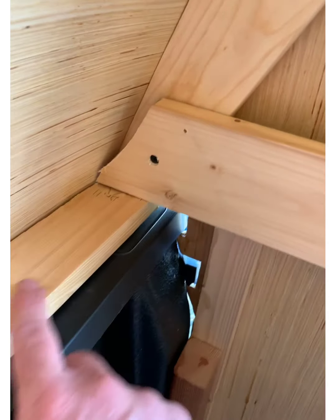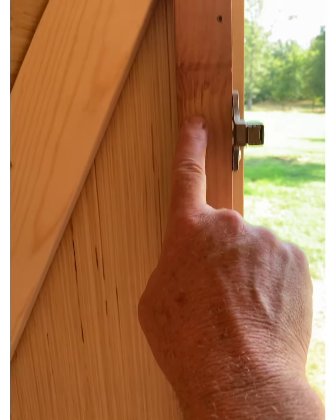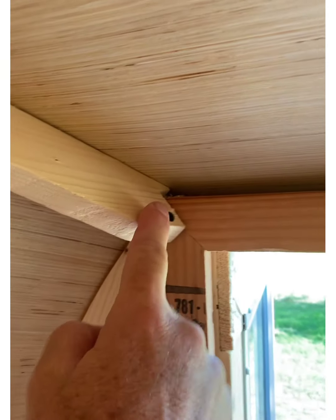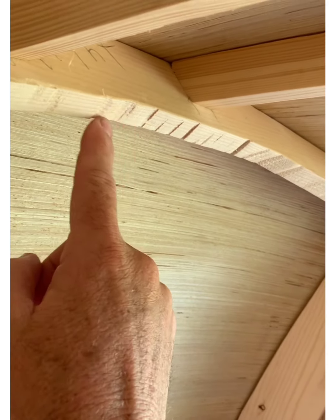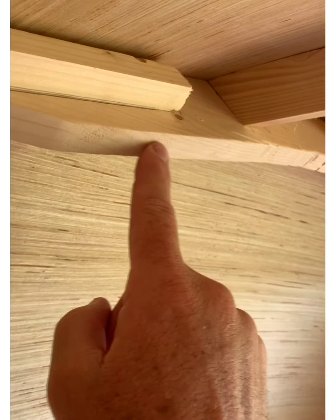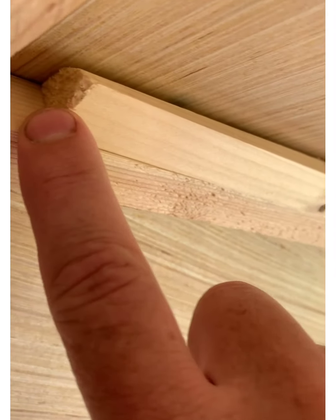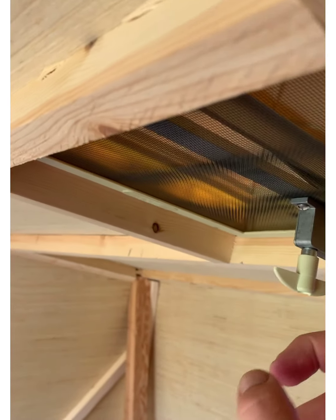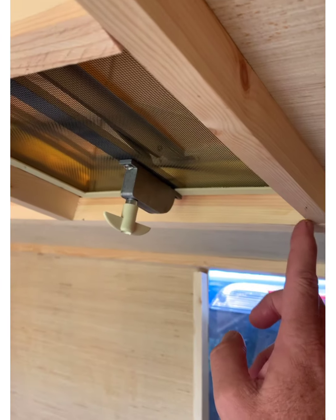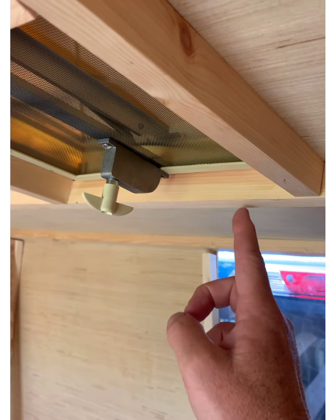When building this, this is a 1x4 here and another 1x4, and I just notched it. This is a 2x4 that I ripped and then 45'd. This is a 1x4 that I kind of curved and hand-cut so it wasn't straight across. That wood planer is very handy for 45-ing all this. So this piece is kind of 45'd there, and the other edge is also 45'd. These I just cut for strength — pre-measured so the center is 11 inches from here to here.